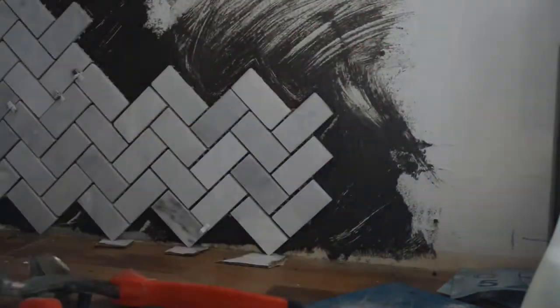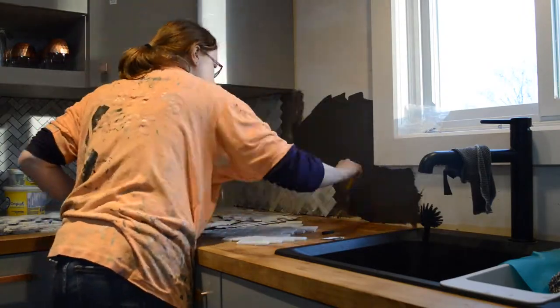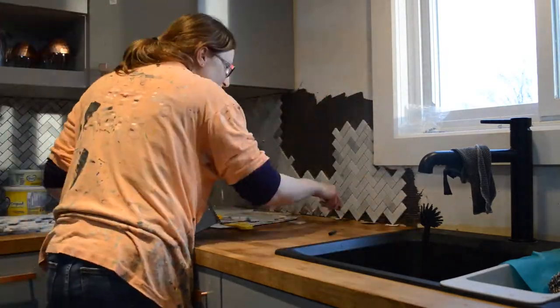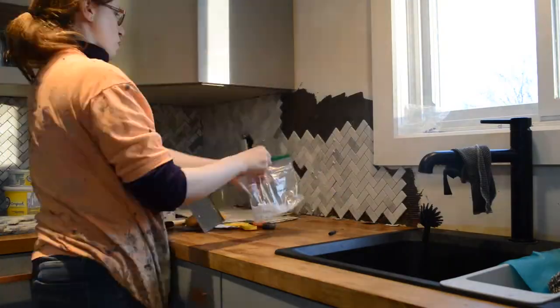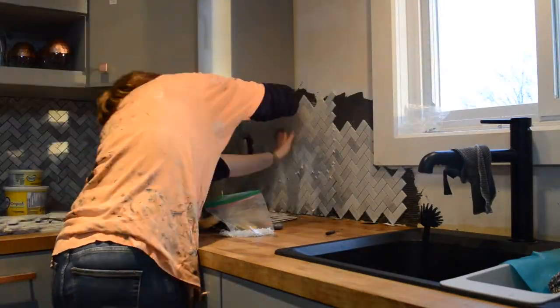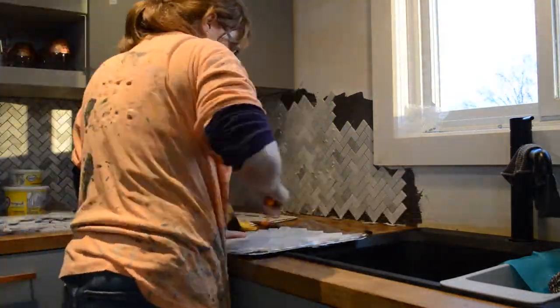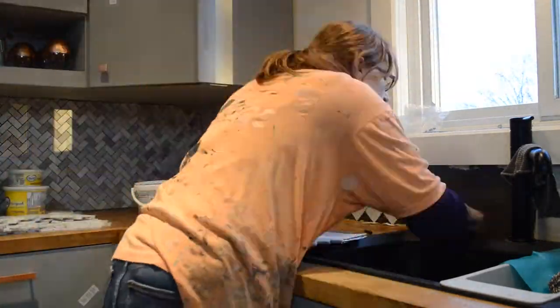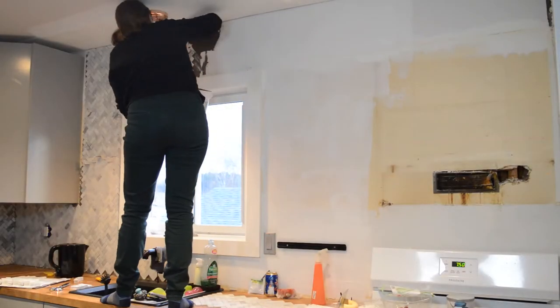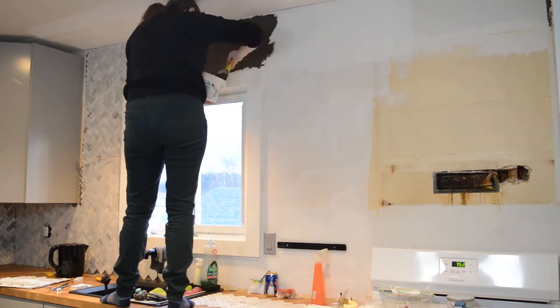If you ever need to take a break when you're tiling, make sure to scrape away as much thinset as possible. I like to use the flat end of a trowel and then wipe everything away with water — you definitely don't want to deal with dried thinset. Another thing to keep in mind, especially with small patterns, is that you should try to go in one direction as much as possible. I was trying to match up the left and bottom parts of the tiles and having issues with my lines lining up, so I had to do them individually. I made sure to have a starting and stopping point when going around the window — I decided to stop my pattern right behind the faucet so that any gap discrepancy would be hidden.